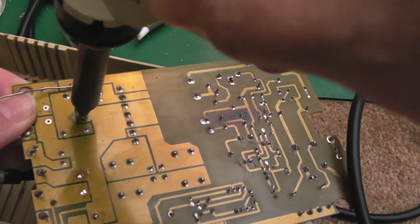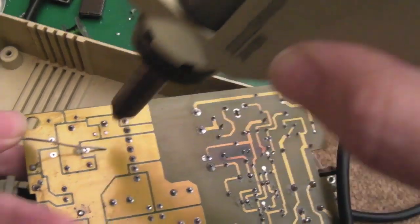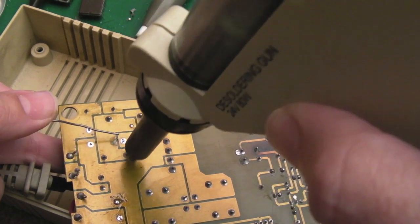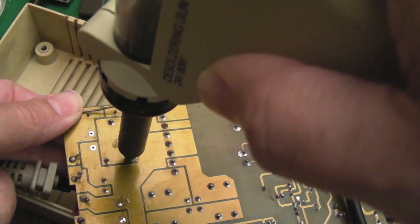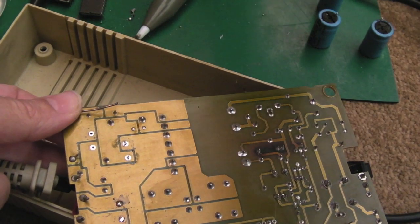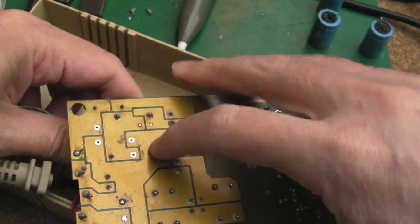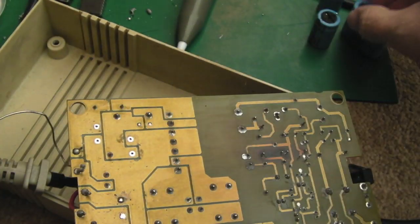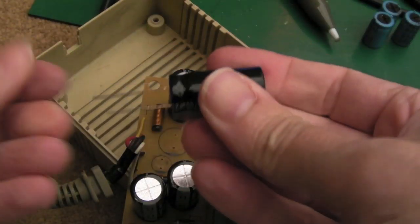Yeah, wait for it to go molten. You can feel it moving. You can see that's one done. Sorry, moving out of shot here, aren't I? Add a bit more solder. Again, just have a wobble around. I can feel the caps loose. There we go. So yeah, the station I've set to 430 because these massive tracks here absorb tons and tons of heat. So yeah, you'll need a pretty beefy soldering iron to remove those caps from this side here. So I'll get the last 2 out.